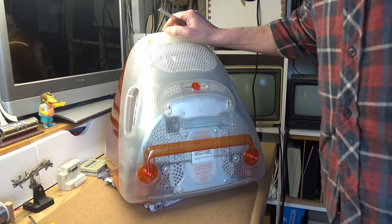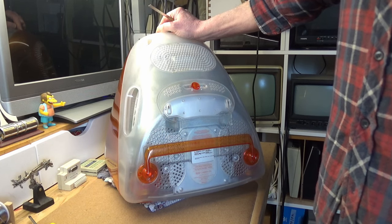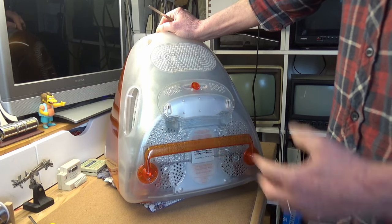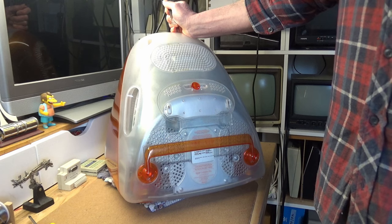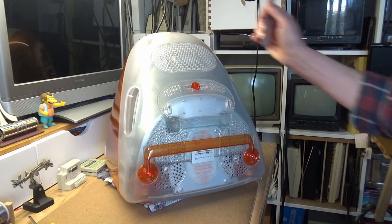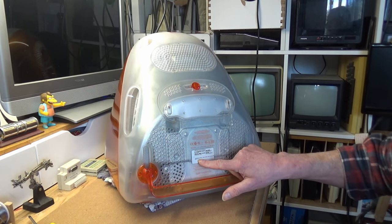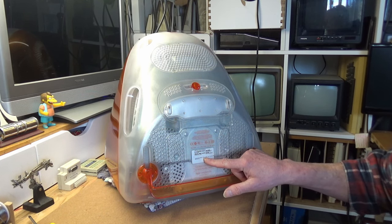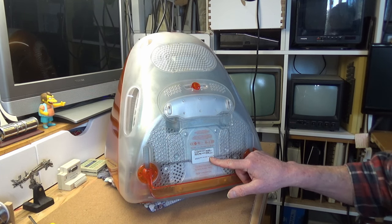Now, I removed the battery as soon as I got this machine home, and that's always a good idea, by the way, because many old Macs still have their original batteries in place, and your first step should always be to remove them. After all, it may be several months before you get to work on the computer. So turning the machine over will also give you access to the model information label stuck on the bottom here. And in this case, I can see that we have a Tangerine G3 running at 400 megahertz with 128 megs of RAM. There is a 10 gig hard drive and it has a DVD optical drive.